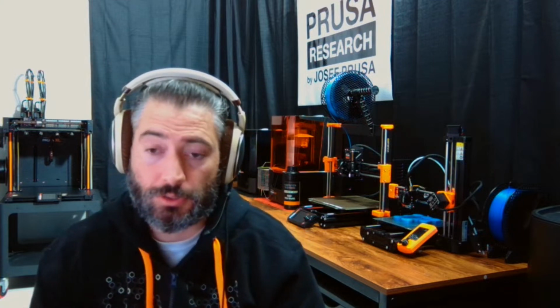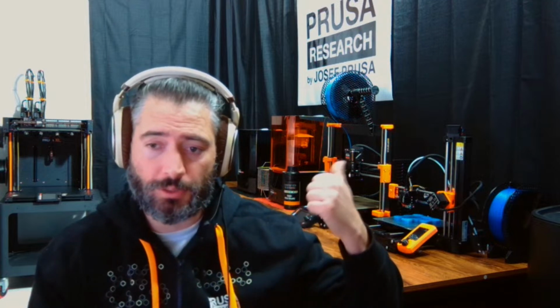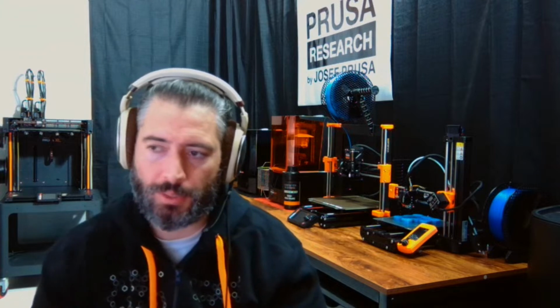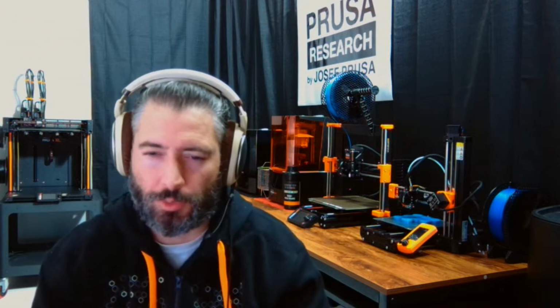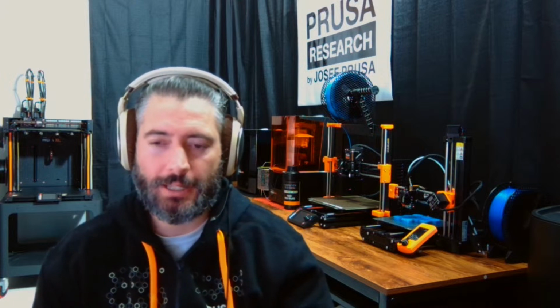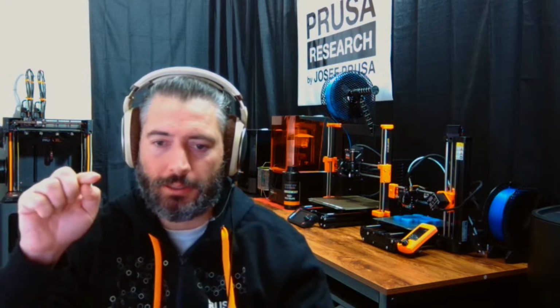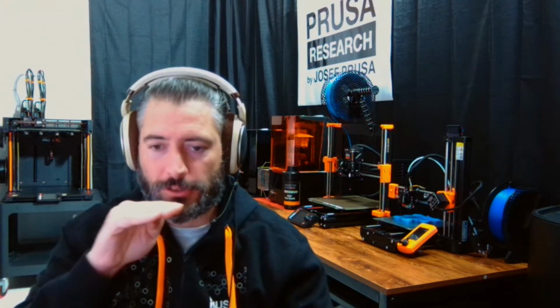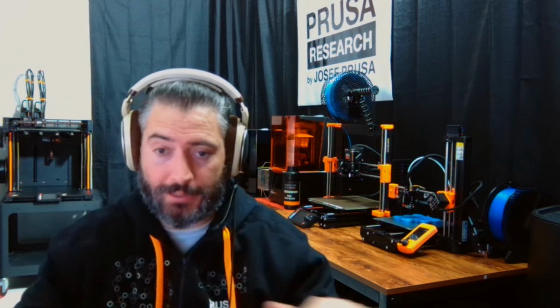and the more affordable printers start adopting the technologies. So there are bed leveling sensors on both of these printers, where it goes and maps the bed out, and it takes so many points. You do a max of 49 points on this guy here, and what it does is it makes a digital map of any high and low spots, and it moves the bed to make up for any of those spots. So the first layer is perfect, and then it slowly weeds out those high and low spots until by 2 or 3 layers in, you have a perfectly flat plane for it to work on,